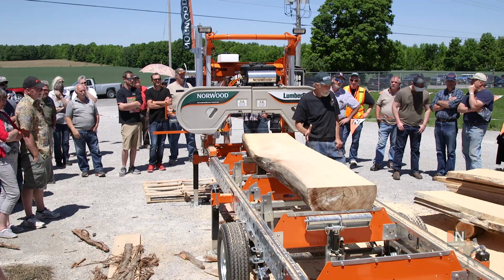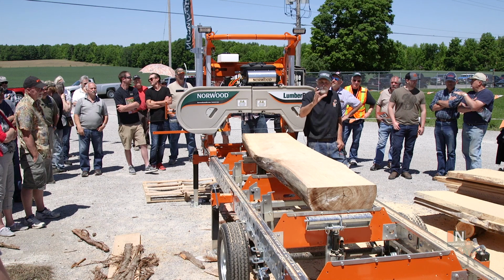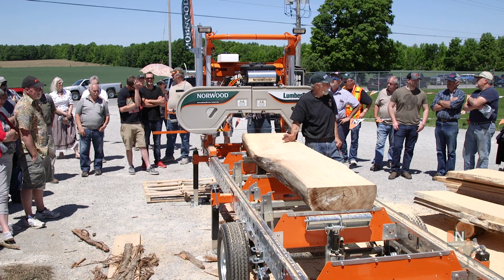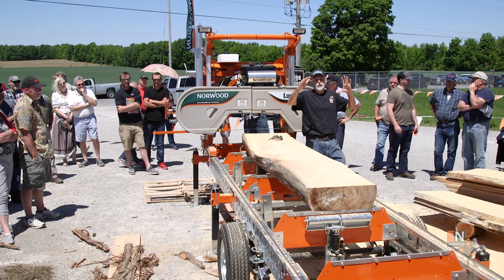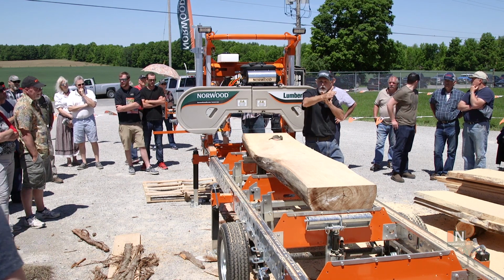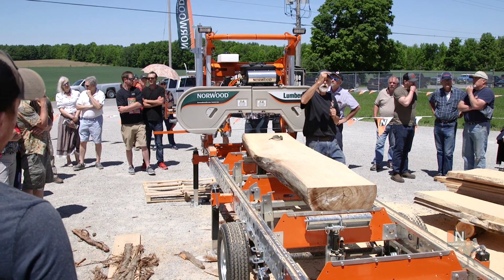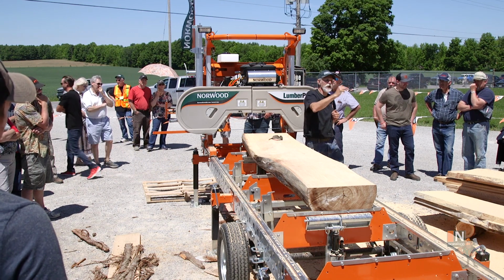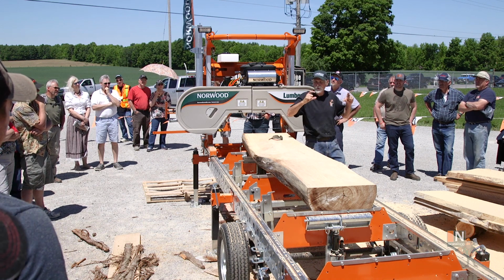Well, for quarter sawing, you really need a much better quality log, something that's straight and without so many knots to it, because that does require pretty good quality. And typically what I'll do for quarter sawing is to come down a little bit above, you level the pith, level the log, and then come down to about a couple inches above the center, make a slabbing cut, then make several other slabbing cuts, because those boards right out of the middle will be pretty much quarter sawn.